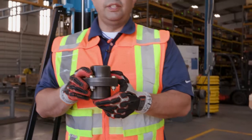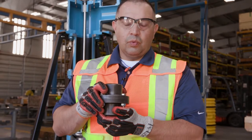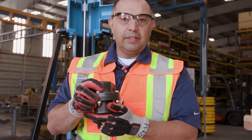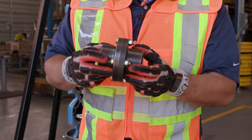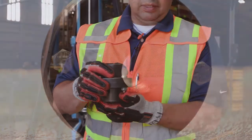This is the adjustable rigid coupling, or the AR coupling as we call it. This coupling is used when you have 350 horsepower or greater. It's also used with hollow shaft motors, and as you can see there are two hubs that come together. Each one of these hubs on the ID has threads on both ends, so you still have a motor shaft and a line shaft that thread into it.